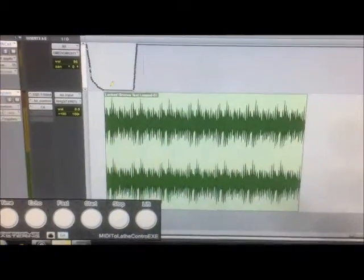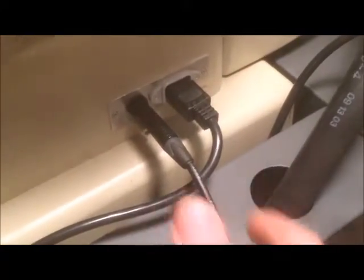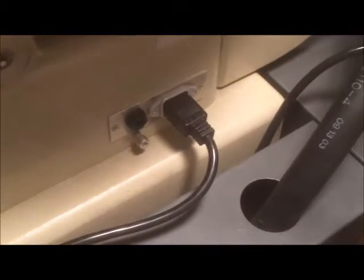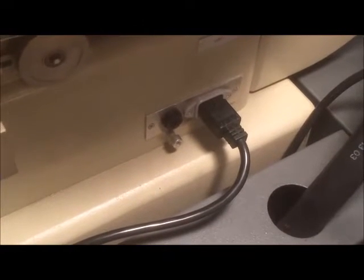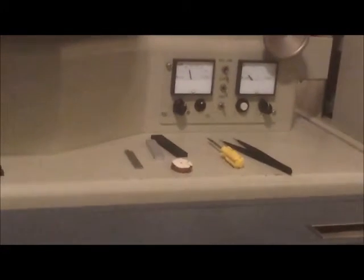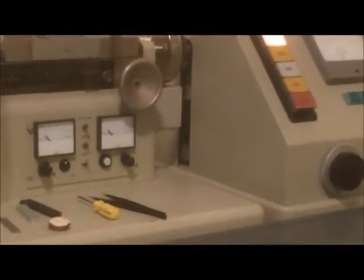I'm going to now show you how I can very easily go back to normal. Okay, so in my installation, I made a little TSR jack here, so when you unplug it, it's now got the normal routing for depth. It's no longer going through my digital potentiometer. Okay, so now we're back on in the depth that's provided by the system, 100%. I'm not interfering with it at all. And what I'm going to do is hit the lift button, and you're going to see the depth gauge go down.